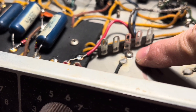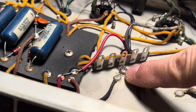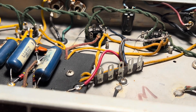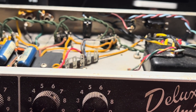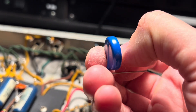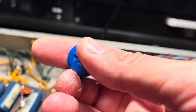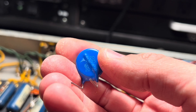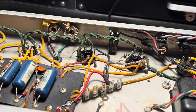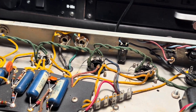There was an existing hole here, exactly like this one — I didn't have to drill anything. And I'm mounting this tag strip here to fulfill your request of adding some MOVs for output transformer protection. These are perfect for an amp like this. This is not a one-size-fits-all solution — you guys need to get in there and do your own math to determine if these specs will work for your amp.